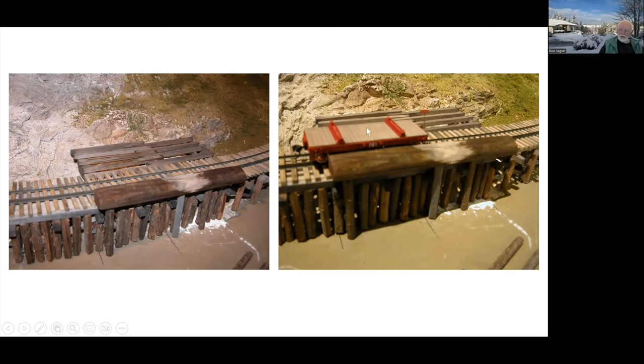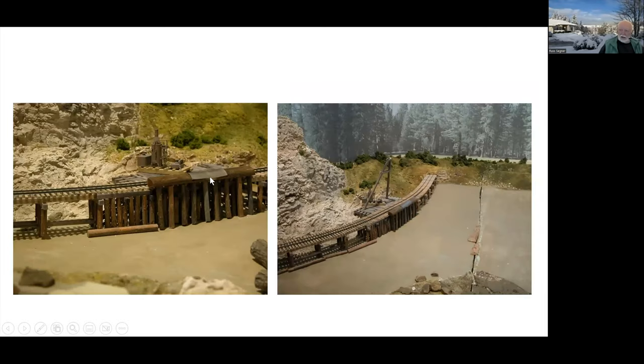Now, this platform is for the operating machinery for that pole to lift the logs. And here's a little more detail with some sheet iron on the brow log to keep it from wearing so rapidly. And here is a small donkey engine that was used to operate the cable for the A-frame here. And then beyond it is a little area where cut fuel wood was stored to feed the boiler.